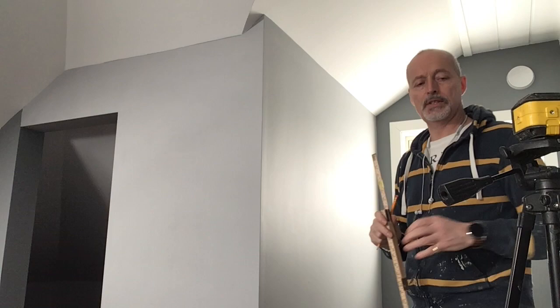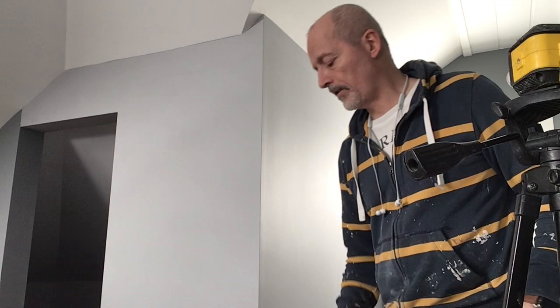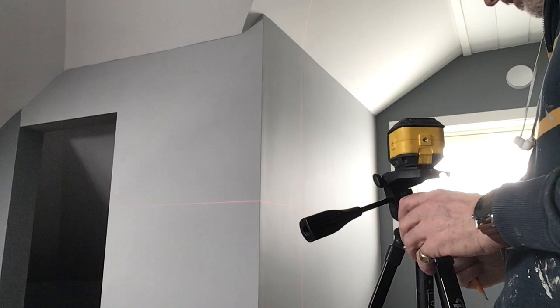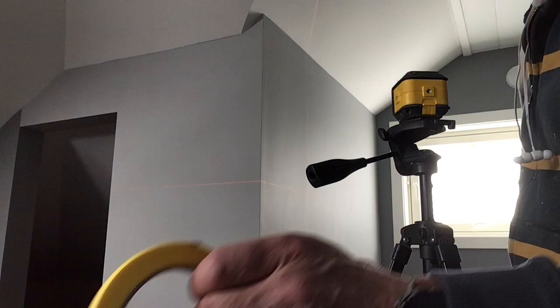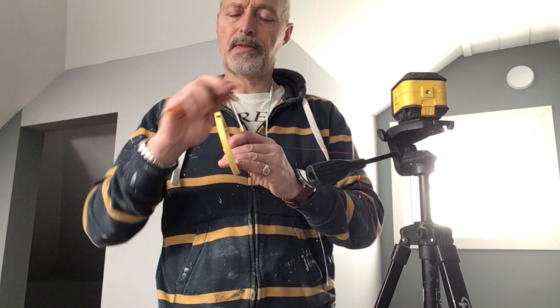Once you've got your little marks on the wall, you need to use a laser level — one of these. They look expensive but they're not. They're fairly cheap and very good for putting up shelves and things around the house — a very good tool to have. I just use a photographer's tripod. Switch it on, then move it up or down until you get the line going through the mark you've made on the wall, then tighten it. All we need to do is mark the area we're going to make the brick effect in.